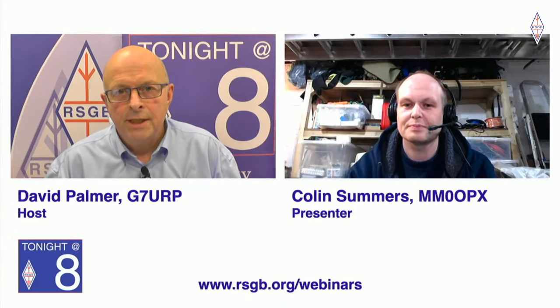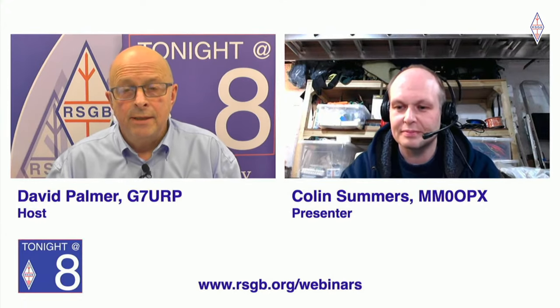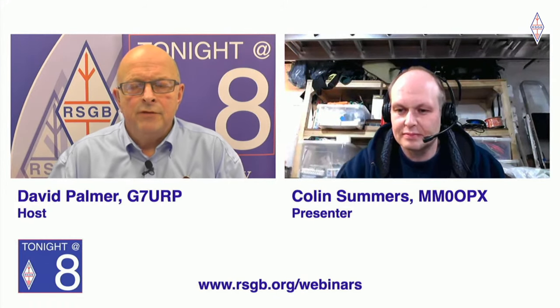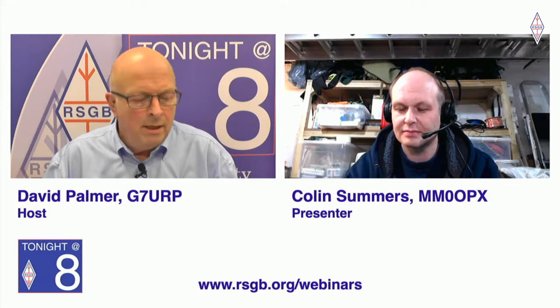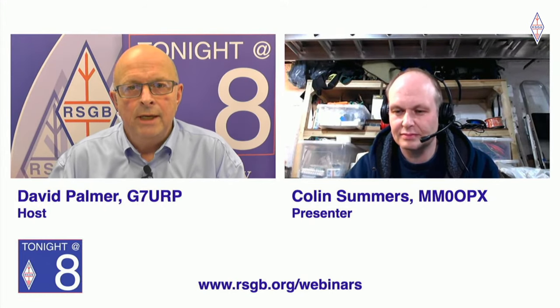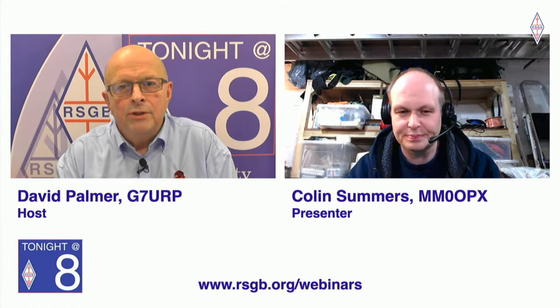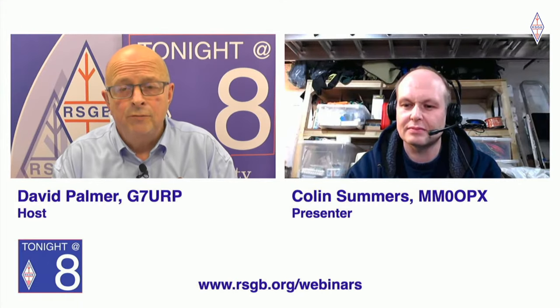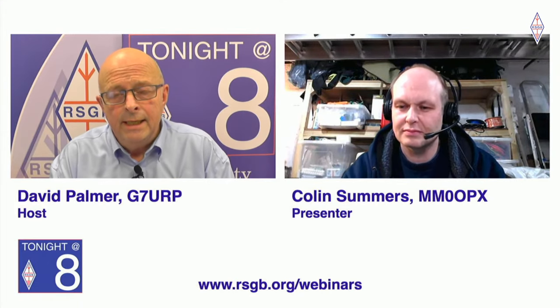Sure, although I guess it's good to have a bit of headroom with these things, and as you say, there are some capacitors which aren't labelled. I tend to use branded ones as well. I think the last time I bought something like this for an EFHW the club did earlier this year, it was about 40p, so it's not a huge cost, really. These cores I want to talk to you about, because I must admit I've tended to stick to the ferrite ones, the ones you've mentioned, the 240 and 43.